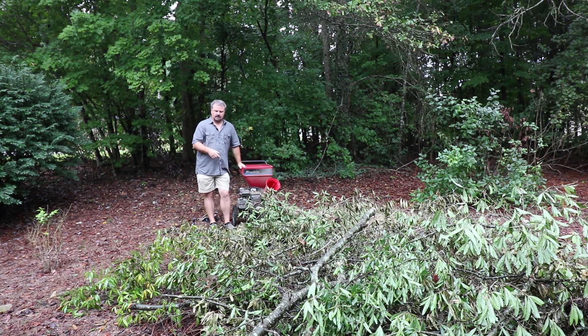I'm going to show you real quick — this is not a video to teach you how to run a wood chipper. You'll have a different chipper than I will. Some are electric now, and those are pretty inexpensive. If you want to stop burning or throwing out organic material you collect in your yard, they're fantastic. One thing to know: you need to chip the material pretty quickly after you cut it. These machines can overheat — the blades can actually overheat if you put in dry material. You can use dry material, but you need to rotate between wet and dry. Fresh limbs like this pile in front of the camera are absolutely perfect to run through it. The moisture in the branches helps cool the cutter inside the machine.